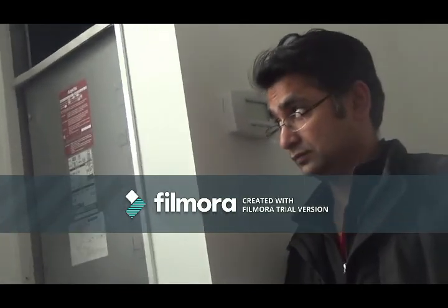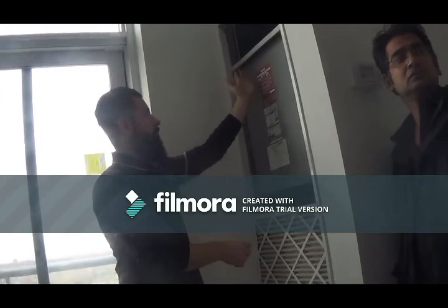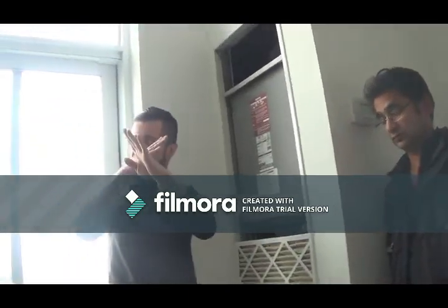So if it's minus 20 out there, there's a sensor in there, and there's a spring closed damper. If it senses anything close to zero, you shut off the fresh air from outside, and it's going to do that throughout the night. That makes sure that once the air passes through the core, it's maintaining around plus 7 Celsius coming out of the core.